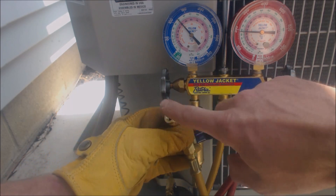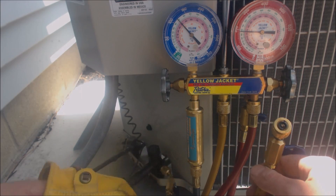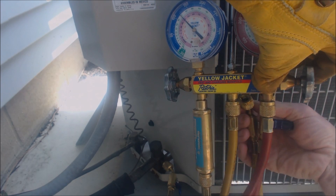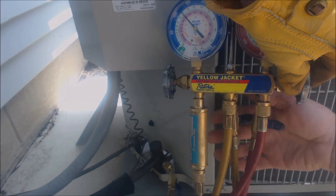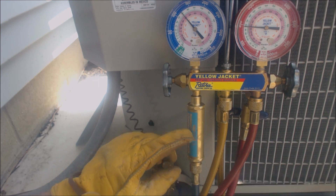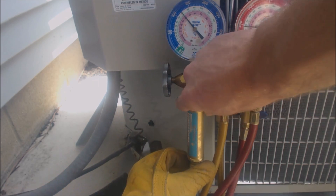We had this connected to the liquid line and it was flowing full liquid refrigerant, so liquid refrigerant was applying pressure under this gauge and then we connected this hose to the yellow hose. We had to bring the liquid over to this yellow line and there was no chance for the liquid to have flashed yet into a vapor — so all that was air until you had the liquid come out. You need to do that so you don't put air into the outdoor unit. If you put air into the outdoor unit, your head pressure is going to rise, which will be put through the system and be extremely inefficient. So now we're going to attach this back to the back of our gauge set and then purge the air out of our blue line. I'm going to purge it here just because this quick charge cylinder doesn't allow for a whole lot to come out the back.